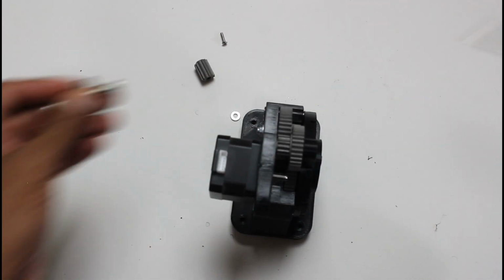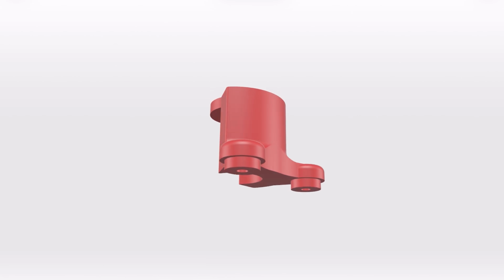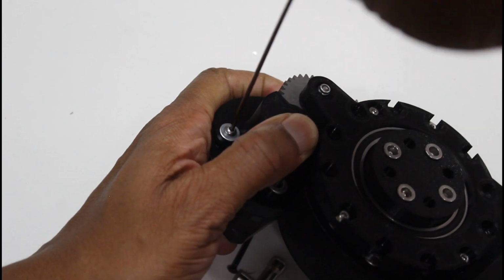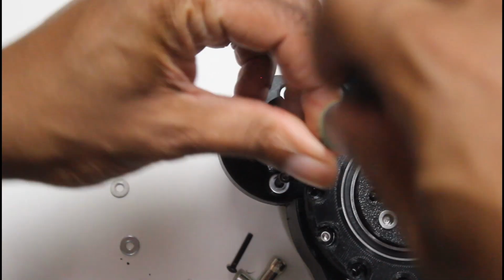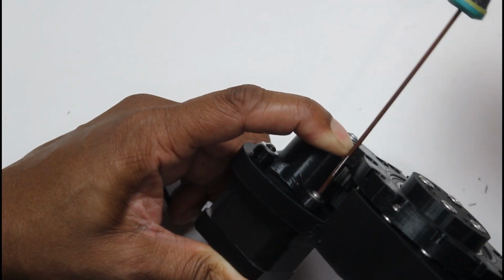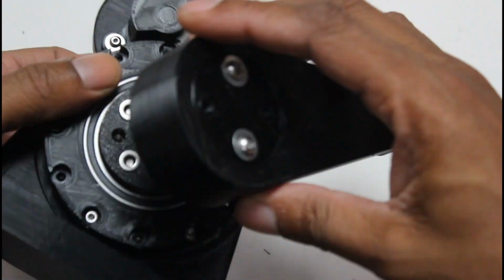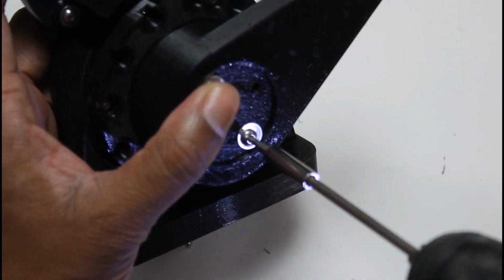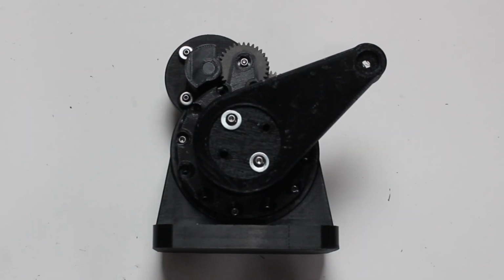After, I secured the protruding M3 bolts with M3 lock washers. The next modified piece is the cover for the NEMA shaft gear, and I'll screw this down with M3 6mm screws, also fully securing our NEMA 17 motor to our actuator body. Once this is done, I'm going to attach our 3D printed lever with a couple of M4 by 25mm screws. I'll definitely be inserting more screws to make sure everything is held firmly, but we're finished assembling our actuator.